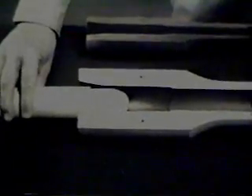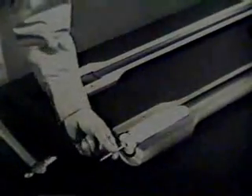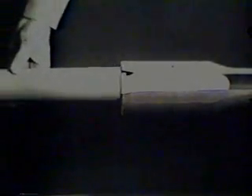Placing the cartridge in the chamber is known as chambering. A sharp tap on the primer would explode the powder charge and drive the bullet out. The same explosion would also drive the case backward out of the chamber. Therefore, the cartridge case must be held in the chamber so most of the explosion will propel the bullet. The part which backs up the cartridge is usually known as the bolt. One end of this bolt fits against the rear of the cartridge and holds the case in place when it's fired.